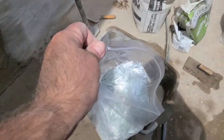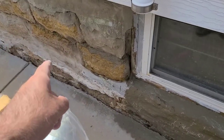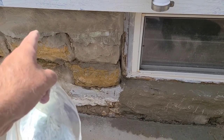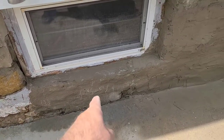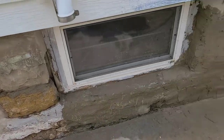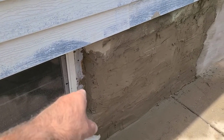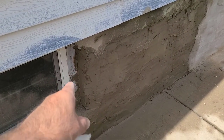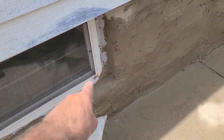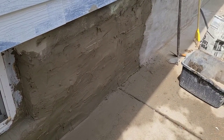I'm going to mix up another batch, put some fiberglass in there, and start filling in this next section over here. I'll mix up another bowl of the portland paint too - not as much this time, just enough for this part. I'll do this in two separate sections. The part around the window well gets a little tricky - it's hard to make that look nice. I'll get that in the best I can, and when I come back with the sponge to fix it up it'll look just fine. The wet sponge will also wipe the mortar off the window frame.